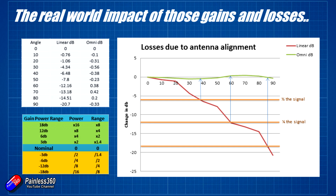This shows how quickly signal drops off with linear antennas, and reinforces the fact that circular polarized antennas give you better reception irrespective of how they are aligned. Whereas with a linear antenna you have to be super careful to keep them ideally within 30 to 40 degrees of each other to maintain a decent signal.